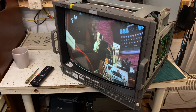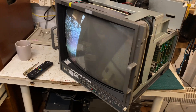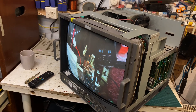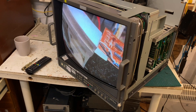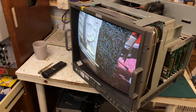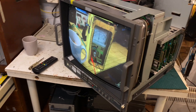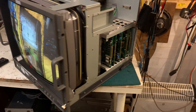These monitors are fantastic — they are obviously broadcast quality. This particular one was owned by the BBC. I don't think it's seen much use because the CRT is fantastic; it doesn't bloom when you turn the brightness up all the way. I've just finished doing a quick service: I've adjusted the convergence, done gun balance and colour drive balance, done the geometry, checked the power supply, measured the ripple current — there is none, thankfully. I've adjusted the main HT line — perfect. 12 volts is dead on.